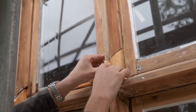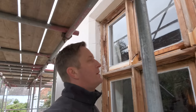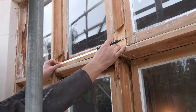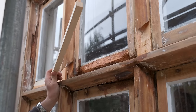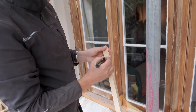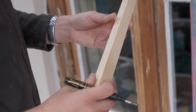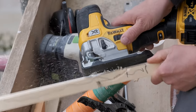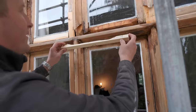Sometimes these old timbers — you never know how much they've had shaved off them. Sometimes they were made by hand so you don't get the consistency as you get on modern joinery. This is a piece I'm using to fill this out in here. I'm just marking out key points — there's a bit of a bump here, you can see it sort of tapers in a little bit. I'm not interested in digging any more out; I'll just freehand with a jigsaw. I'll put a key point on there which is where the rest of that is. I want that to stay in — that'll get cut across there, that corner will stay in, and I'll try and match the profile as much as I can. It's a little bit of trial and error. And this is just packing — there is no finesse to this whatsoever.